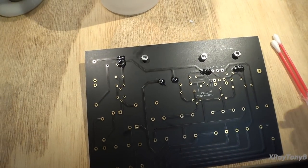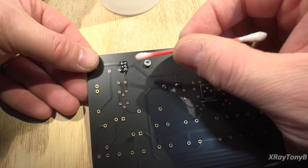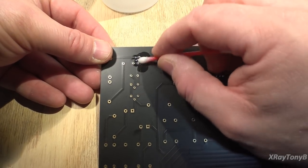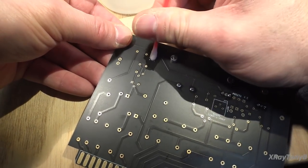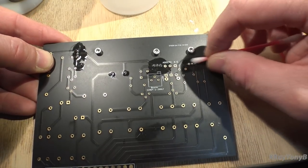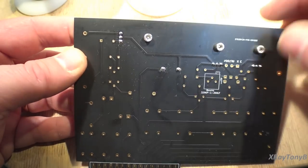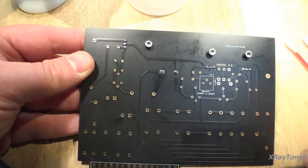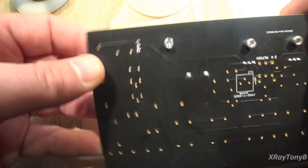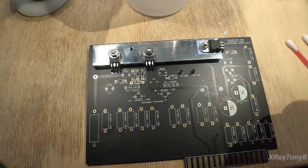When you're done, it should look something like this. The flux residue in the solder really won't hurt anything, but if you don't like the look, take a cotton swab soaked in isopropyl alcohol and clean it off. After it dries, that's what it looks like. One disadvantage of the black solder mask on the board is that — like a black car — any little bit of dirt or fingerprints shows up more than any other color. But there it is — that part's mounted and we can move on to the next part.